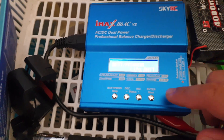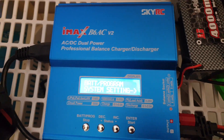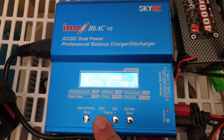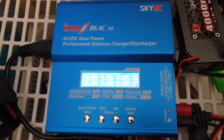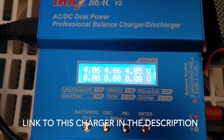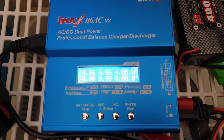I'm going to check the battery level and see what the voltages are. I've plugged it into my SkyRC IMAX B6AC version 2. There's a lot of imitation chargers like this, and you might pay two thirds of the price, but you're better off paying a bit more and getting a genuine SkyRC product — because the copy will probably break and you'll end up buying one of these anyway. The cells are reading 4.06 volts each, so it's just a bit above storage charge, but that's fine.